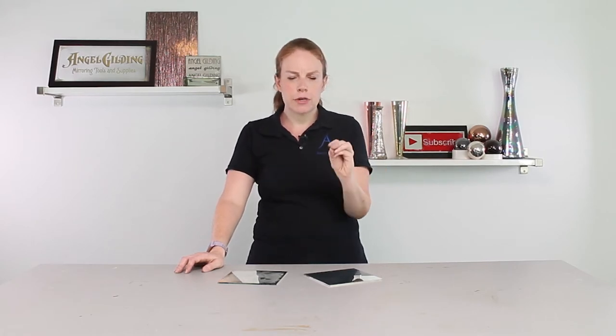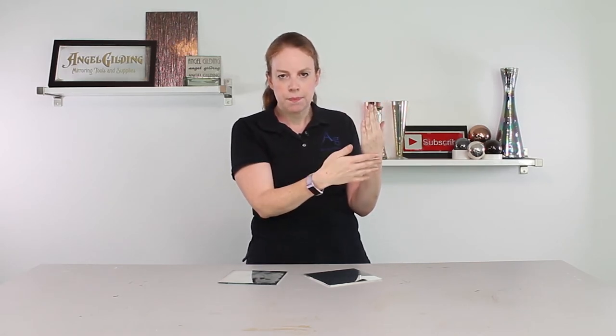I just threw out a bunch of terminology, so hang in with me. When I say first surface, front surface, or spray chrome, I mean the surface on which the silvering is deposited. When you think of a mirror in its most traditional basic form — say a bathroom mirror — you're looking at the glass with the silver deposited over the back of the glass, with a backing paint applied over the back. That's a second surface mirror. But a first surface or front surface, even a spray chrome surface, is an oftentimes opaque piece with the silver applied over the front and a clear coat applied over the front of that. So there's no glass between me and the silver — I'm essentially looking directly at that silver with just a small protective coat in between.